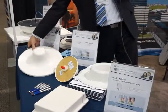Here I would like to add one little thing. We have this shaped antenna. We have three products in the same box. The one is our typical SISO going from 698 to 6 gigahertz. The other one is from 380 megahertz to 6 gigahertz. And then the European high band MIMO in one box goes in the same shape. So you can really play with your installation and with your planning to combine those different antennas in the same venue. They all look the same, but they do different things. So it's really giving a lot of flexibility for the engineering companies.